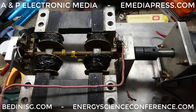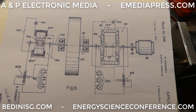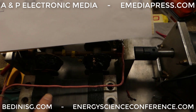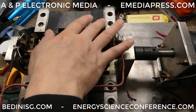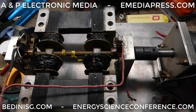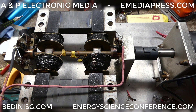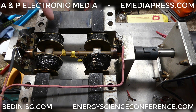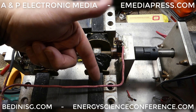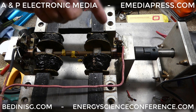This side is a Kromrey generator; attached to the shaft is just a DC motor to the right — I'll show that with a flywheel in a bit. What I do want to point out is that in the presentation Peter mentioned you have to build it exactly like this, and that's true. Most people are using permanent magnets right here. It's a lot easier, and in the Kromrey patent he also used electromagnets. In the permanent magnet version you can see that the magnetic poles need to alternate — if this is south, that needs to be north, then this needs to be south and this needs to be north. Just as long as they alternate.